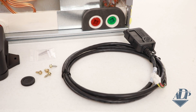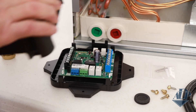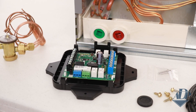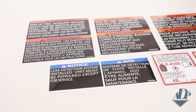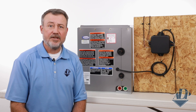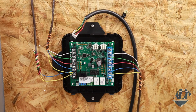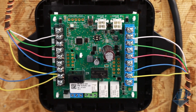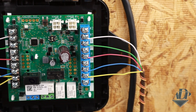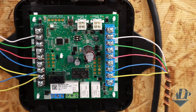The RDS kit includes a dual-calibrated sensor for both refrigerants, a control board with an enclosure for easily mounting to a nearby surface, mounting hardware, and all the necessary warning labels for the appropriate refrigerant. The sensor has an 80-inch cable giving you multiple options to mount the controller, and the sensor cable has a molded plastic connector that easily plugs into the controller. The controller operates from 24-volt input and has large screw terminals making it easy to install.